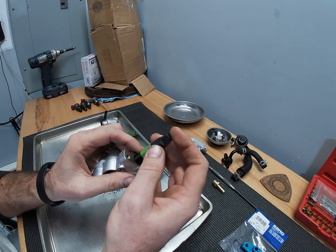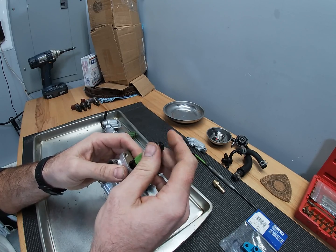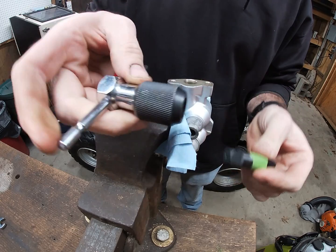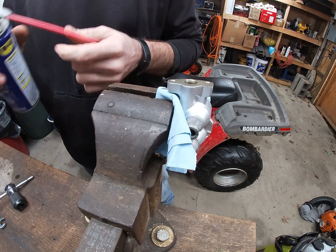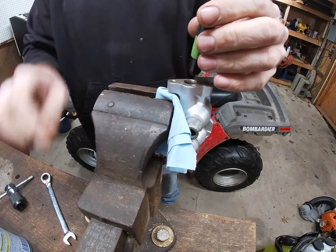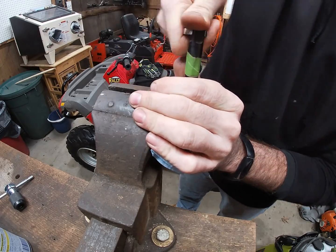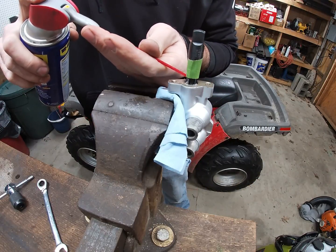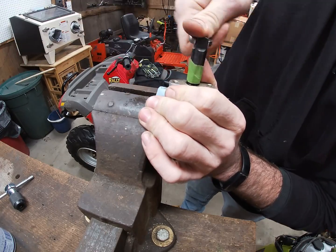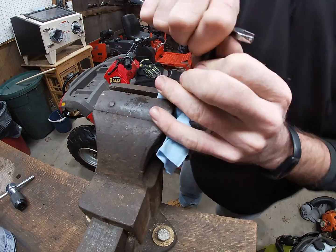When you're tapping you need to make sure you're not getting it at an angle — you want to be perfectly flush so it sits down. Lube it up with some WD-40, motor oil, or synthetic gear oil, which works great for drill work. I ran into a snafu — my tap was too big for my tap holder so I had to improvise and use a wrench. I was extra careful to keep the tap very straight, kept it well lubricated, and for about every three to four half-turns clockwise I gave it a half-turn counterclockwise to make sure the metal shavings didn't get in the way of cutting new threads.